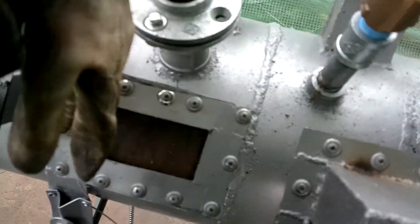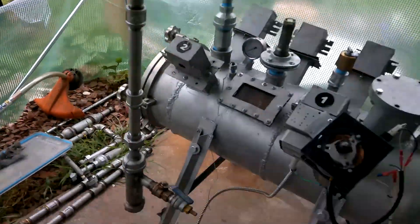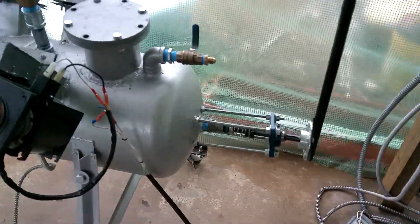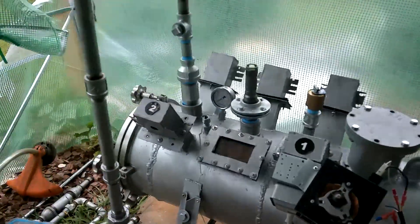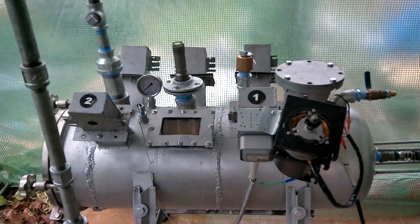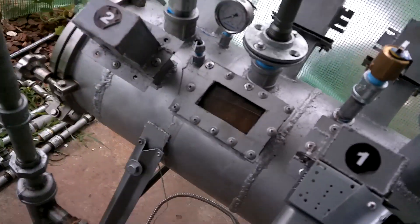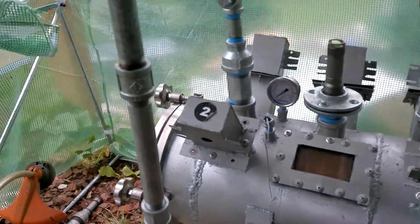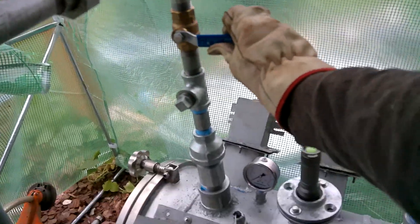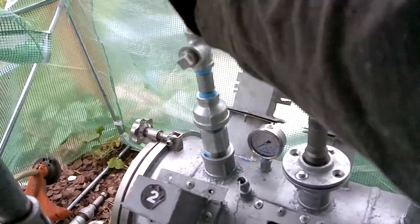This is the argon input, output, shaft — sealed. We're going to pump some argon in, get the water bubbler going, get all the oxygen out, and then turn the microwaves on — just one magnetron, no agitation. We got the argon coming through; you can slightly hear it coming through the water bubbler, which means we have this thing nice and sealed. Let me close this valve for a second so we can build up some pressure to get all the air out — I want all the air out.